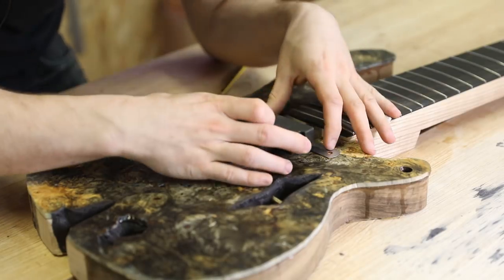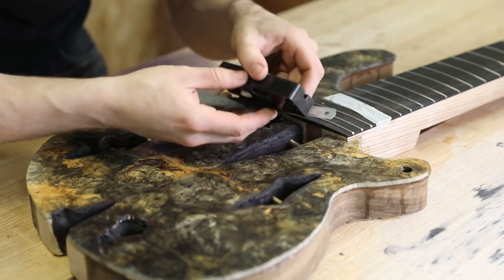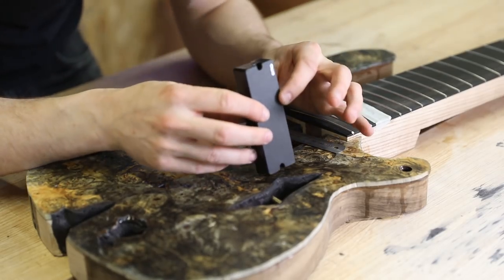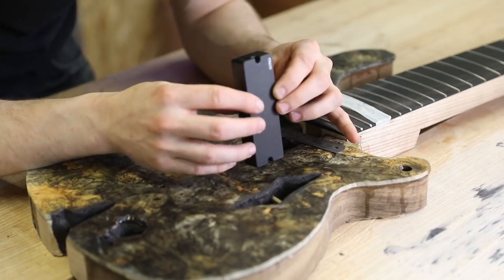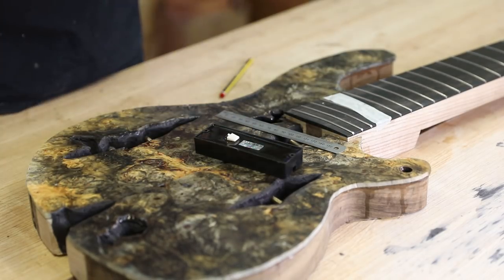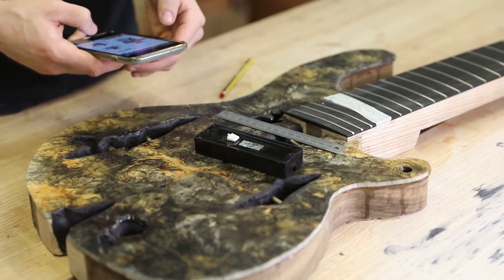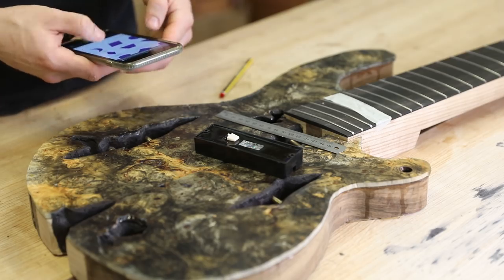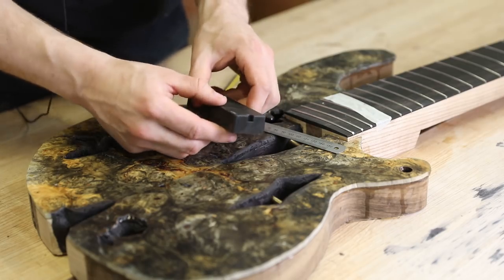What I'd love to do is just trace around the bottom of the pickup, but one, it doesn't sit flat on there because of this thing poking out the bottom. And I could put it upside down and trace around the top of it. However, the actual profile of this pickup looks to be slightly... what's the shape? I haven't done geometry in ages. It's the one where the two sides go up like a pyramid. Trapezoid — that's the one. It's slightly trapezoidal. So what that means is if I trace around the top, by the time I try and press the bottom in — which is slightly larger — it ain't gonna fit. So we do need to trace it around the bottom, somehow with the magnetic bloody ruler.